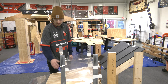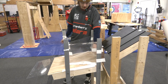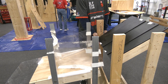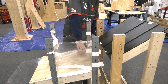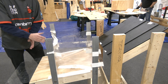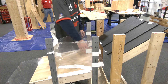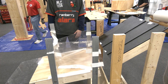For this intake, we currently have it set at a 10-degree slope, and this top point is set at 33 inches from carpet. On the human player station, this point was set around 35 to 37 inches, so from there we want to give it a little area to fly into our robot. Our goal is to vector it into a single place so we can index it and score it. Our surface here is polycarbonate, and we'll be demonstrating multiple different surfaces and showing what angles work and what angles don't.